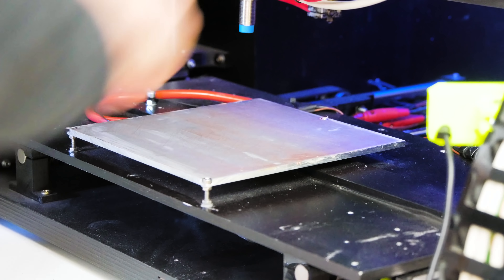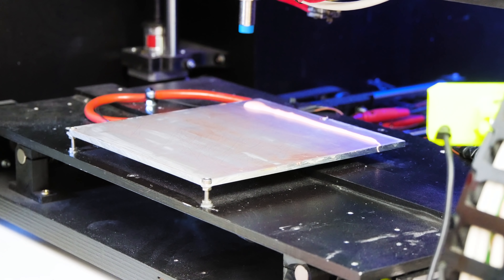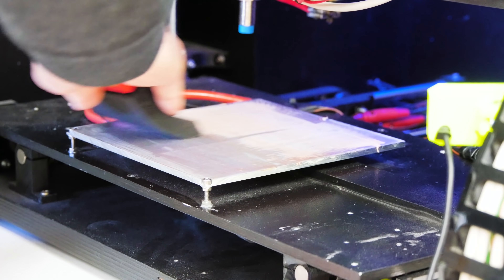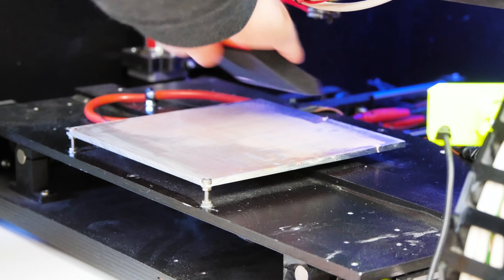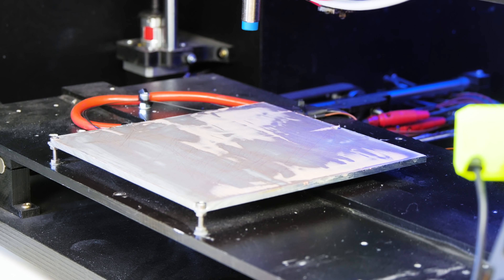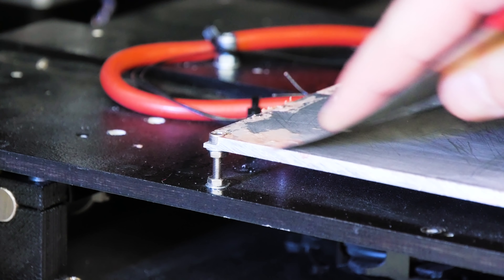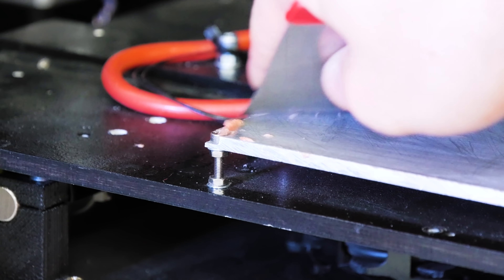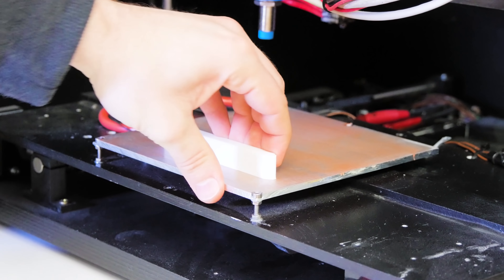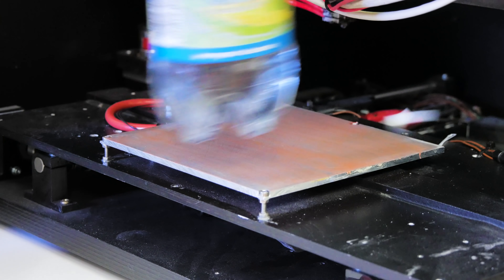3DEs is odorless and, if I had to guess what material this was, I'd say it's a polymer-filled PVA glue, but I'm probably wrong there. It leaves a film that is very robust and can be used for many prints without reapplying. It's easy to touch up and easy to remove with some warm water, as the entire film will completely turn to mush and you'll be able to scrape it off. Acetone or alcohol don't seem to attack the surface, so you can use those to clean it. Definitely better with a heated bed than without one — all the heated prints turned up perfectly, but the cold PLA print already showed some warping, and PET or ABS onto a cold bed failed completely.